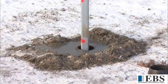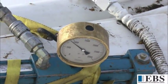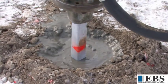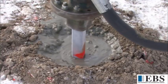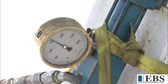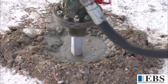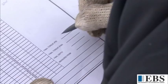The level of grout is maintained. The installation torque is monitored by using a differential pressure gauge. The pressure reading from the DP gauge is correlated using a calibration chart and provides the torque applied to the pier, measured in kilonewton meters or foot-pounds. As the pier advances, the level of grout drops as it is pulled deeper into the ground. As torque on the shaft increases, the shaft will begin to twist. This twist is an indication that the pier is beginning to reach its maximum torque limit — it is designed to do this.